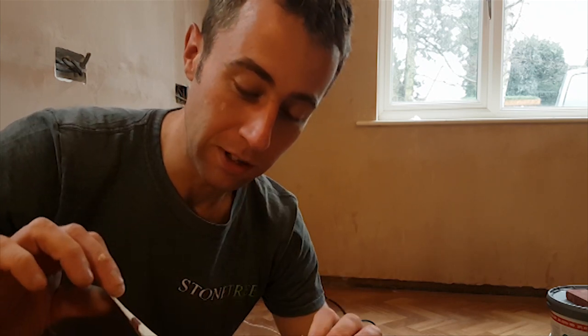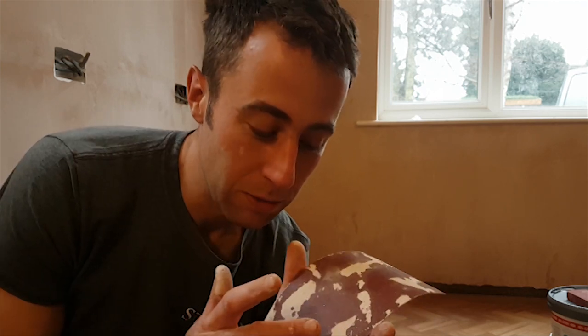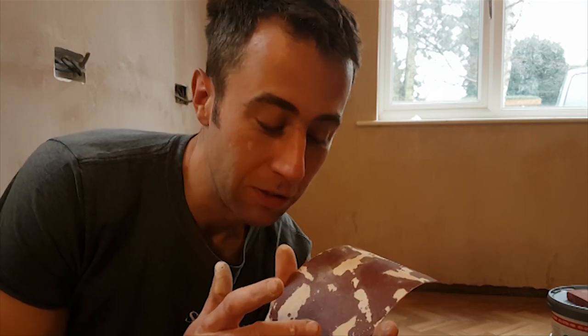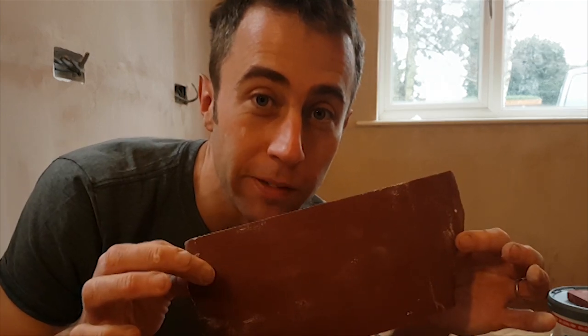If you've got quite a few lumps and bumps you'll need a fair bit of sandpaper, as it fills up the pores quickly with plaster. Good sandpaper is brilliant but costs a bit more. Just because it's clogged doesn't mean it's no good - an easy way to clear it is with a hoover and a brush attachment, and then it's good to go.